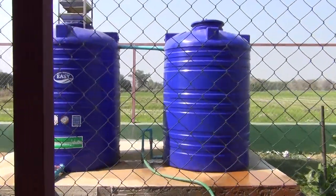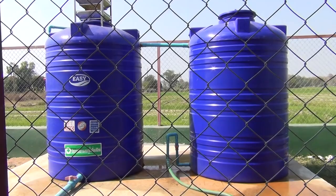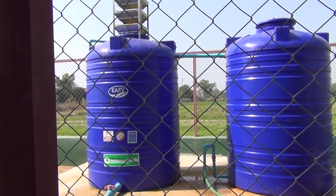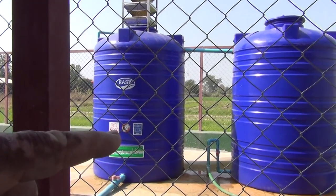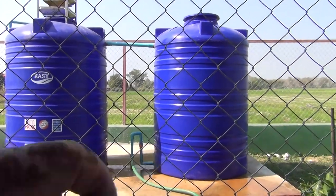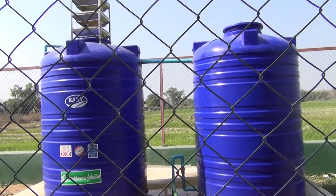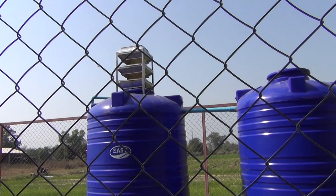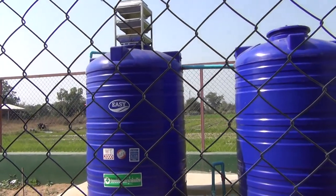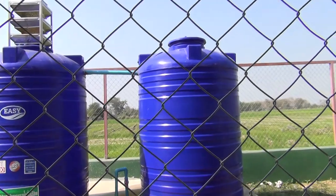This morning, the well guy came by. And we talked about adding a filter tank here, cutting these out. And what we will have to do is feed the water from here through a pump to the filter and then back over to this holding tank. And what that filter will do, it will take all that rust out of there. The aerator up here will separate the rust. The pump will force it through the filter, and the filter media will capture all the rust.